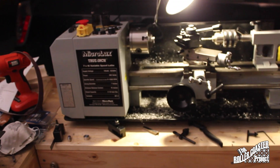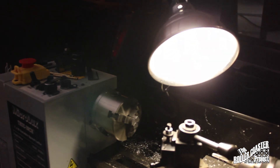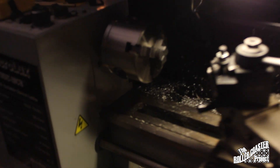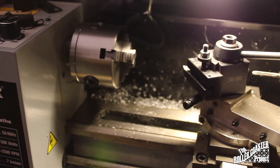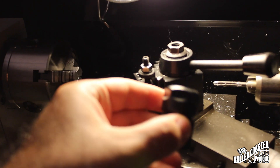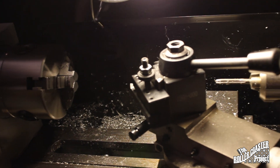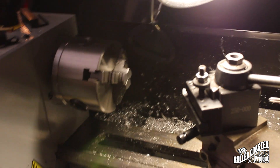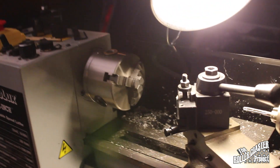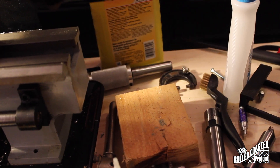We've been redesigning the axles on the rollercoaster cars, and I was having problems with holding everything in the three-jaw chuck. What I'm doing now — I got a small adapter to hold an ER-16 collet, so I'm going to use that to hold it so I can do the threading via a die. And I have a little die arbor back here, which I'm sure you guys have seen.